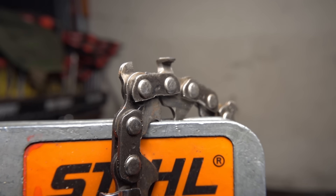The most important thing to keep in mind: it doesn't matter if you have the world's greatest chainsaw. What really does all the work is the bar, the chain, and the sprocket. Looking after them is the most critical part of making your saw have a long and happy life. You can get by with a below-average chainsaw if you have above-average knowledge and skill related to chain. Take the best saw in the world, put a below-average chain on it and it's going to be crap. Take a below-average chainsaw, put a great chain on it and look after it well, and you'll do a lot of work. Everything will last longer, it costs less money, and it's much easier work.